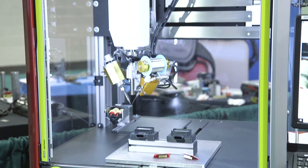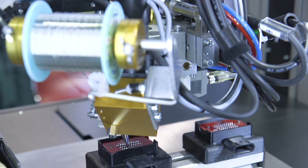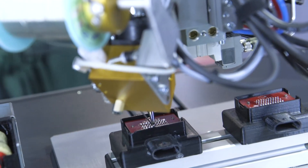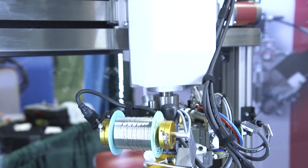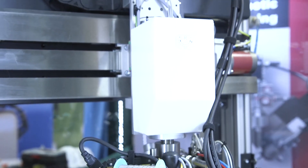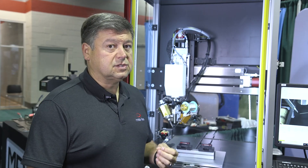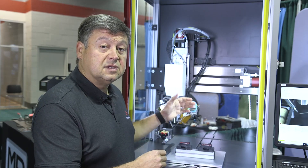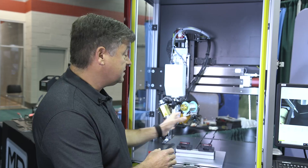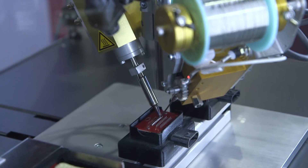All of the bracketry on this unit is billet machined to give you a good robust structure. This is really important because if you don't have your wire feeder directly at the head — for example if you mount the wire feeder at a static location and push the wire through a feed tube to reach the solder joint — you really start to lose control over how much wire you're feeding to the joint, both from the springiness of the feed tube and because the wire changes length as the head moves in X and Y and rotates.